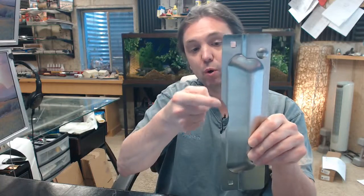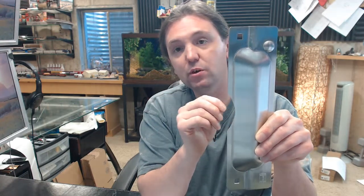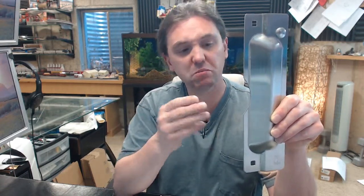This is a unit that is going to be used with rosettes. Okay. A dimension here is not given for the diameter of the rosette that can be used, but you'll be using like grade 1 cylindrical lever locks. This is known to be compatible with. If you had something unusually large, you might have what's called a unit lock from decades ago that have significantly large rosettes and greater back sets as well, 3 3/4 back set. This probably wouldn't work for you.